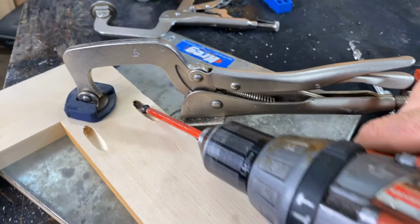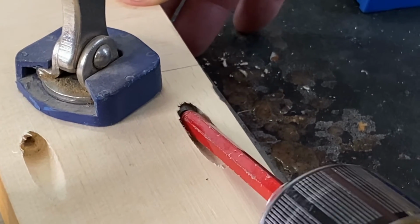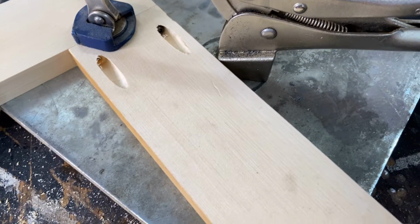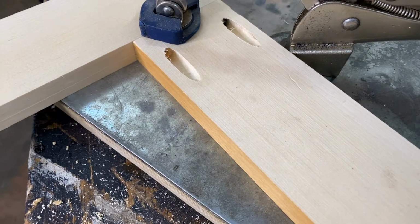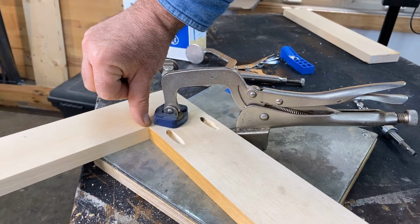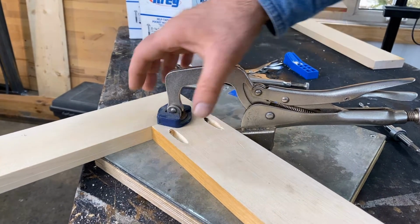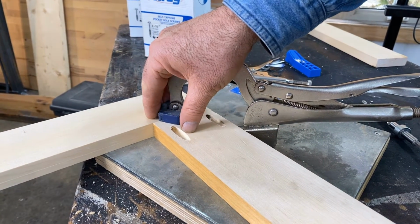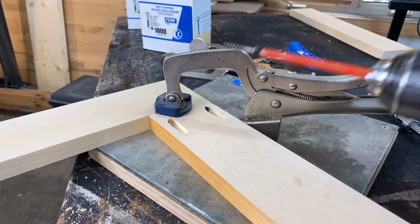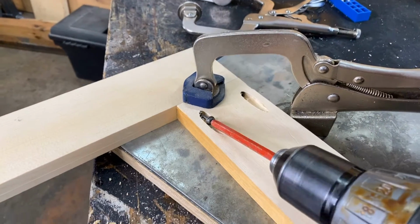And that's it. Did you see how that other side of the wood moved a little bit? It kind of pulled in tighter. Because this clamp holds the wood down with a lot of force, so it's flush here, and it's not going to get out of alignment on the side. But this clamp does nothing to pull the joint in tightly. That's where the screws come in. You often see the pocket joint being pulled a little bit tighter as the screw is driven home.